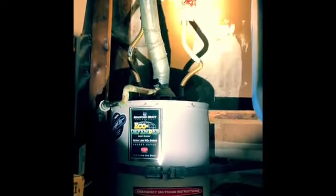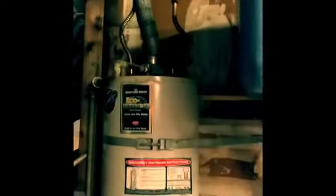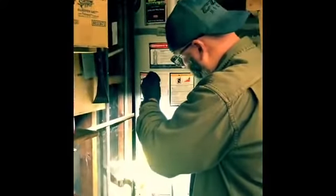This water heater also has some corrosion on the connection up there, as you can see, behind the valve. We'd like to obviously see that replaced. That could lead to further leaking of water and whatnot. Okay. Everything else with this particular water heater, it's strapped properly. This here is really important. This is your TPR valve. That extension is going outside, which is correct. We either like to see it route to the exterior or have it come down the side of the water heater at about 6 inches above the ground. But this is sufficient here.